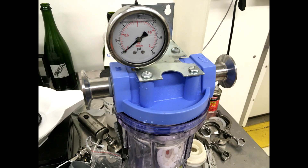Take your pressure gauge and gently thread it in, and eventually you'll get resistance. I like to have the face of the gauge facing me, and I like to buy the accessory mounting kit so the gauge faces away from the back mount. You have to put the back mount on before you put the gauge on — keep that in mind. Some people might want the gauge facing towards the hose as it enters the canister; you can do that too. Make sure the mount is on before you put on the gauge, otherwise they get in the way of each other.